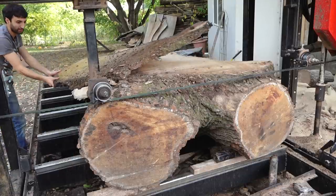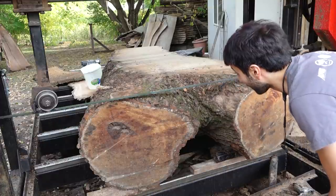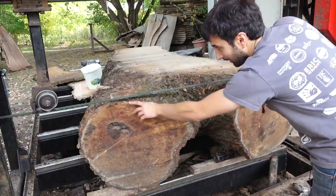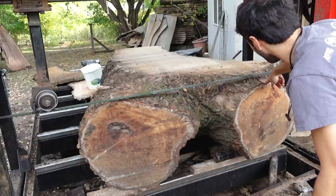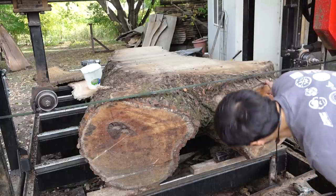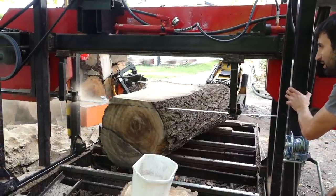A goofy board. So I think at this point I might just go into making slabs, since we're getting into the top of both of the limbs here. This first one I'll probably go a little thinner, maybe like a 9/4, and then I'll try and grab a couple pieces of 10/4 after that, which should have the most amount of crotch figure in them.